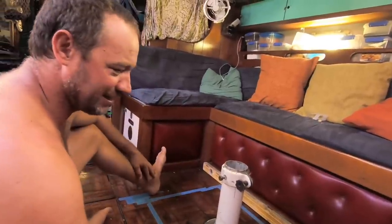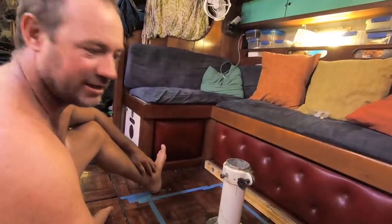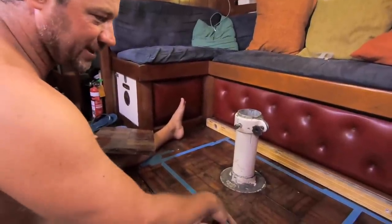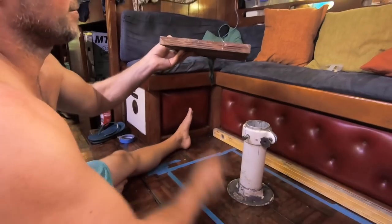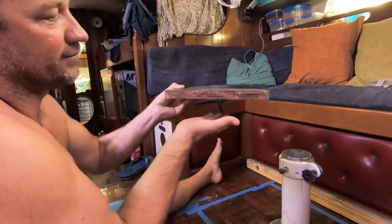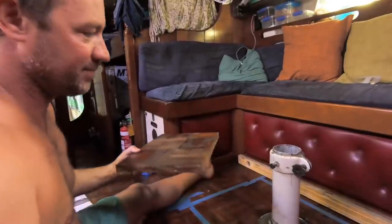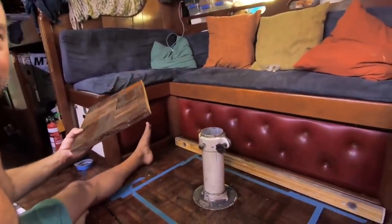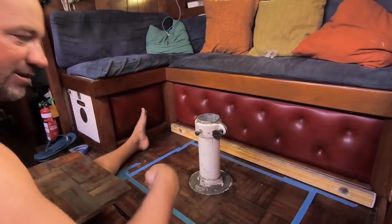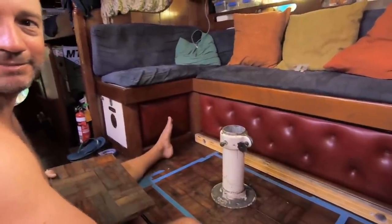If it all works out, I cut this open and there's enough room — fingers crossed. I've just taped out the size of my lid here on the ground. I'm going to set my saw blade to roughly the thickness of the floor tiles and the timber. Underneath that is another layer of timber which I'll cut a little closer so it acts as a lip to sit on. Then I can cut my hole out, place the batteries in, tie them down, job done.